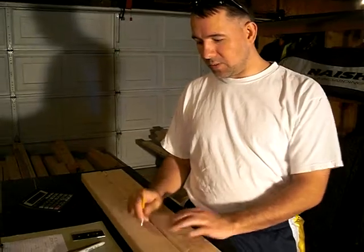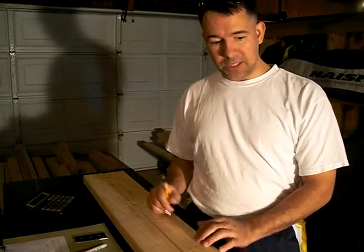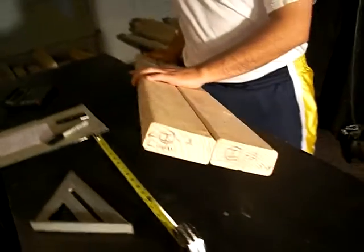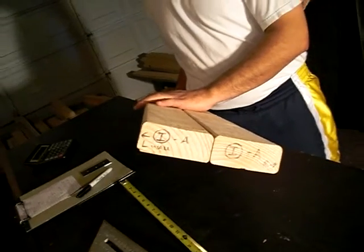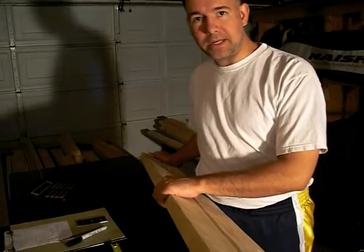If this was the HX-1, this is wall member I. If this was the CS-1, this would be wall member G. We've got one for the right wall and one for the left wall, and if you look on the end here, you'll see how I mark them. I put a circle around what member it actually is, and then the other letter is the wall frame that it intersects into.